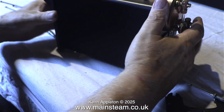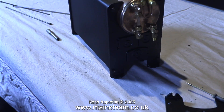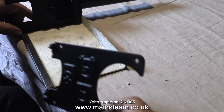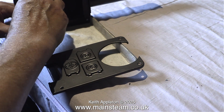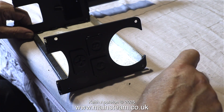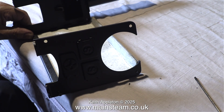It's really important before tightening the nuts on the end of the rods to make sure the boiler sits square on the bench and doesn't wobble about. You can do this quite easily by slightly moving the position of the boiler's upright frames. If you don't do this, you can have a big problem — you may shear off one of the feet, and this has actually happened to one of these boilers. In this clip, I'm assembling the second 501 boiler and making sure the bottom rods are in line with the casting at the other end. I was actually working a little bit too close to the edge of the table, and dropping these cast parts onto my slate floor would not do them any good at all.